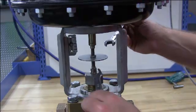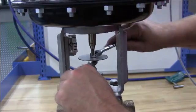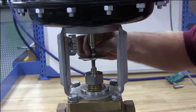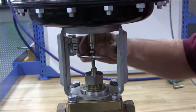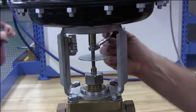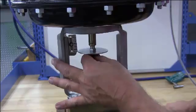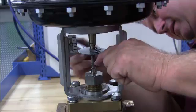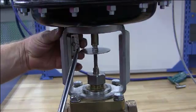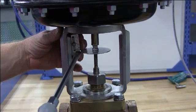With your air remaining on, take the two half inch wrenches, loosen the two jam nuts, and bring the top one up until it touches the actuator stem. Snug it to the stem and do the same with the second jam nut. Using both wrenches, tighten it up all the way. Using a screwdriver, readjust your travel scale so that your indicator is right on the zero.